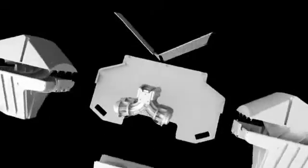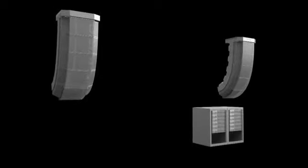We have six individual devices that build up, and that diffraction slot continues almost uninterrupted right the way down the complete array. If you want to construct an array where you want to throw pretty far to hit the people in the rear seats, but your throw distance is pretty short to the front and you don't want to overpower them, you can create a curved array — or what we call a progressive directivity array.